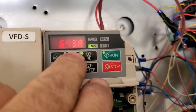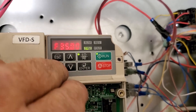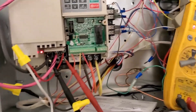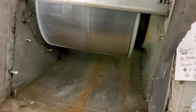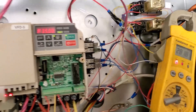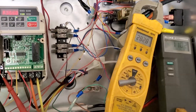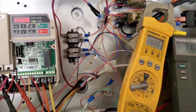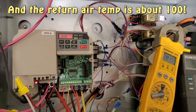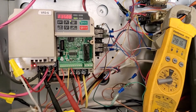35 hertz, 6.7 amps — that's output amps. I don't know what the input amps are because it's DC and I can't just put my meter on there. Getting some cool air here, it's probably pretty hot in the garage. All I want to do is just see if my solar panels would fire up this compressor. I'm thinking that if the water was cold I'd probably be able to get maybe the full 60 hertz out of it, but the water's hot so it's more the high end — the compressor can be very loaded.